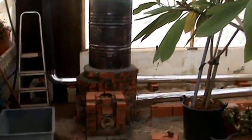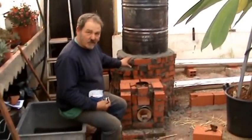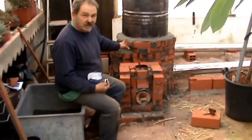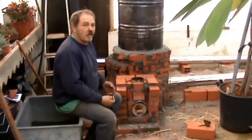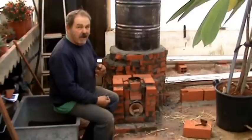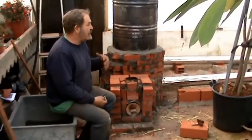Get the place warm. Thank you very much, Martin. You cannot use Portland cement — normal cement — in the construction of these. I have bought a refractory cement; there are various types to withstand various temperatures. The locals in this part of the world would have used sand and white clay and hydraulic lime as a mixture in domed bread ovens to hold the bricks together.